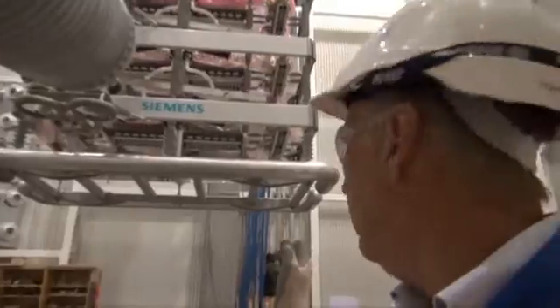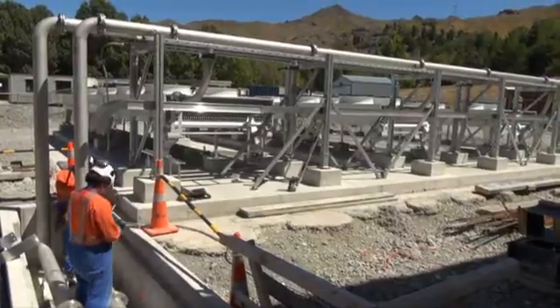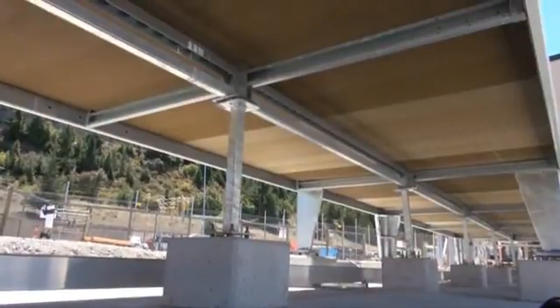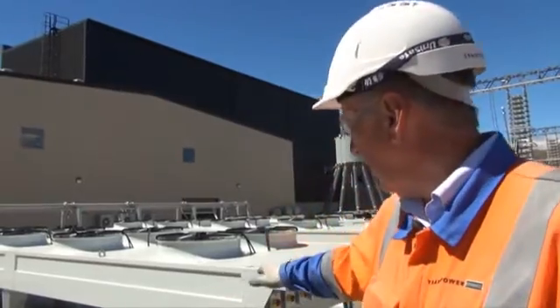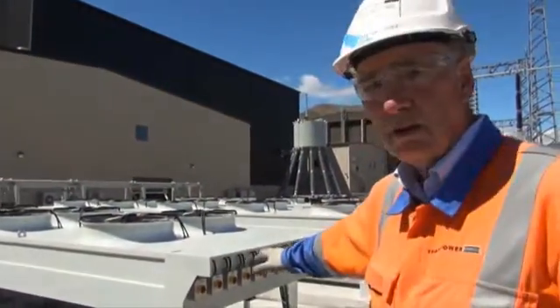You can see across the far side, going through the wall, is a cooling water system. All the thyristors are water cooled — there's a large cooling water system outside. Because of the heat created by the thyristors they need to be cooled, so water is continuously circulating through the valves and through these cooling systems. You'll notice there are about ten fans on each cooling system, and there are three systems — one for each valve. Underneath there's a cable ladder for the control cables and supply cables for each fan, with ten isolating switches on each group to control and isolate the fans.